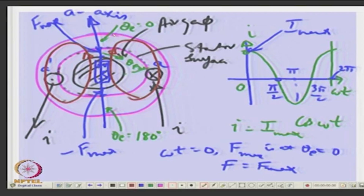So, which stator is at higher potential or the rotor is higher potential, and where? Okay. So, at this point this is at higher potential than this, is not it, because only then the flux can go from rotor to stator surface at this point. So, at this whole area, stator surface is at a lower potential than the rotor surface. Is it clear? So, from here to here, okay, and whereas say from here to here, what is happening? Stator surface is at a higher potential compared to the rotor surface magnetically. So, that is what we call a magnetomotive force or MMF.